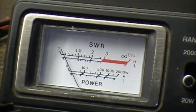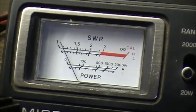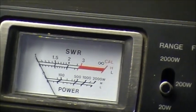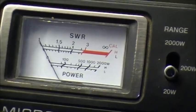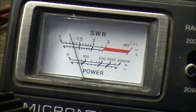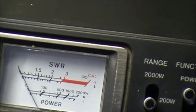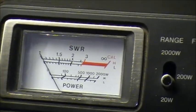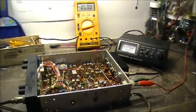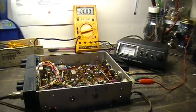Victor Ocean One Mike Delta Zero, test test, five five five five, one two three four five — there's upper sideband. Then going to lower sideband: test one two three, Victor Ocean One Mike Delta Zero testing — we get about two to three watts. So AM and FM are at full power, CW is at full power, but SSB is heavily reduced power.